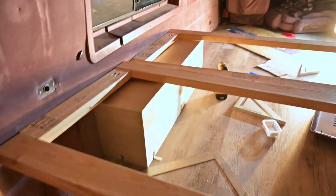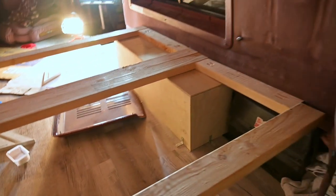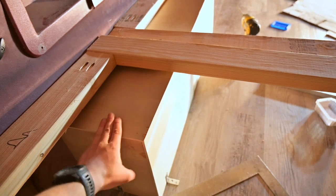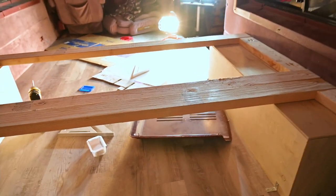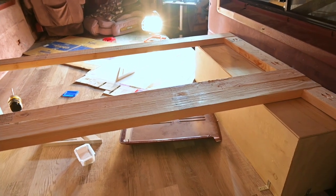I got the outline of the frame completely finished — all wood glue and pocket holes — and I have two of the same shape. The next step is to raise this up and put some legs underneath. If I'd thought about it I would have built those boxes higher so the frame could rest on them, but it's going to have legs down to the box on either side, which gives a bit of extra storage. There will also be legs in the middle and a wall splitting it in half so the back and front storage each go halfway.